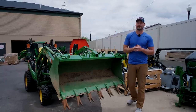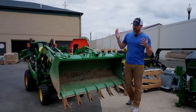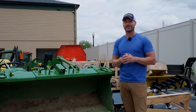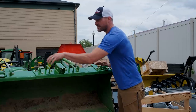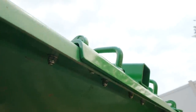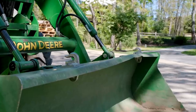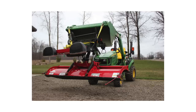These next three are going to be combined — not only am I telling you about the most versatile tractor attachments, we're going to give it to you in the most efficient manner. Number one up top are these bolt-on brackets by JU Fabworks for all sorts of John Deere buckets. He's coming out with versions for other buckets as well, so Kubota and Mahindra owners be patient. There's going to be some sort of a universal bracket you can bolt on. These are going to open up the versatility of your tractor, but they're also going to reinforce the top edge. The standard John Deere loader buckets are just a thin piece of steel — you'll see these get bent in or out all the time. This is going to provide a lot of additional protection, with a variety of chain hooks, D-rings, grab handles, a two-inch receiver you could use with a drop hitch — a lot of ways to secure equipment or material to your bucket, or tie off something and drag it.